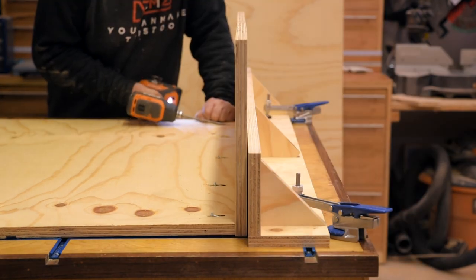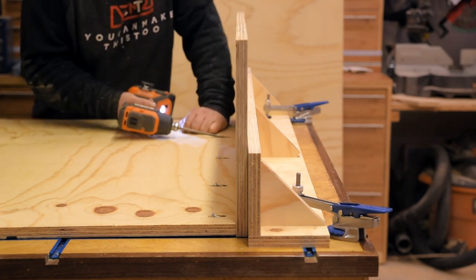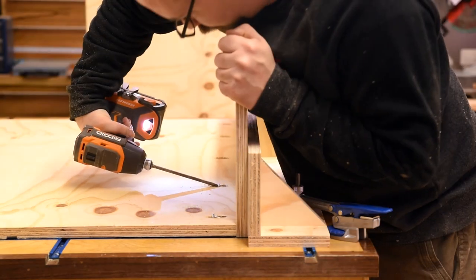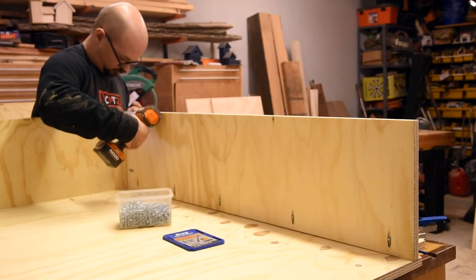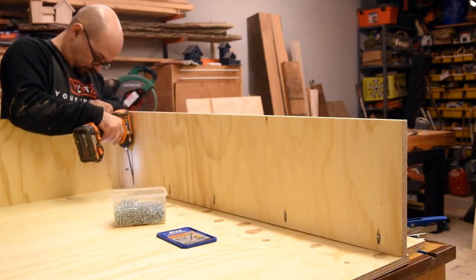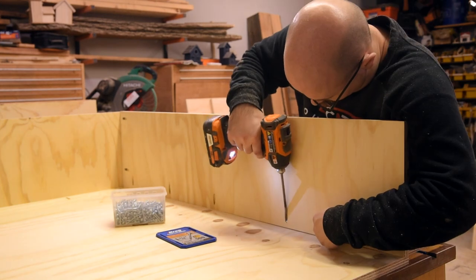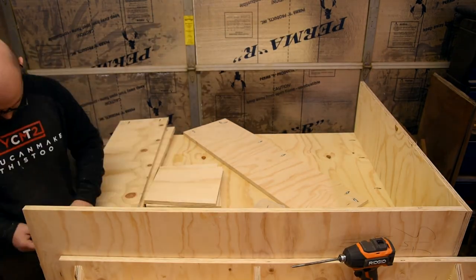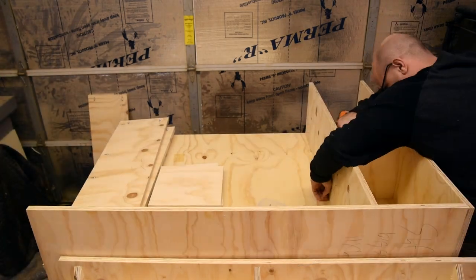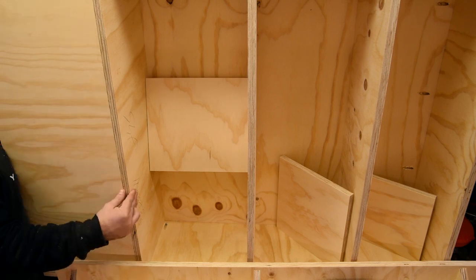But much to my surprise, the pine plywood wasn't perfectly flat, so to aid in assembling the bookshelves and drawer and closet combo, I made a 90-degree fence to put on my assembly table. This helps hold the pieces and lets me push against the tabletop before the fence forces the pieces flat as I screw them together. For things like the shelves, I cut spacer blocks and used them as a guide to keep everything square during assembly.